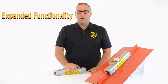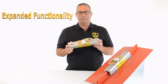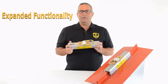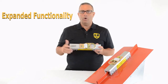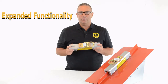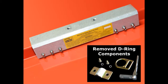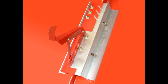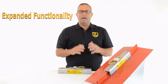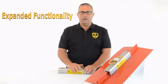Number six, we're getting into our adapter plate. The Standing Seam Roof Anchor has adapter plates that expand its functionality. If you're installing solar panels on a steep roof and your guys need walk boards, you don't have to go out and buy a separate set of walk board brackets. You can use this device — mount it on the seam, remove the D-ring, and use our SSRA-2 roof jack adapter. It drops over the anchor body and locks on, and then you have two-by-ten walk boards that go across the brackets. Very simple design, very cost effective, and it allows you to take the same SSRA system and expand it to do other things you need to do as a contractor.